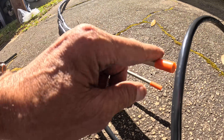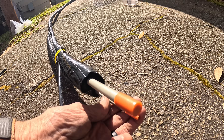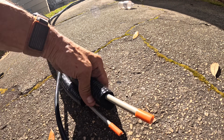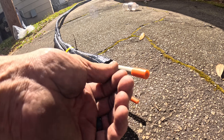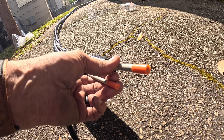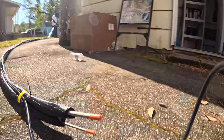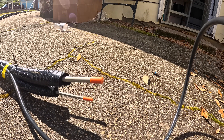I'll show you what it looks like. You can braze on this with 45% silver, copper to steel, and they want you to cover it with a shrink wrap if you heat it up and braze on it or if you sand on it, because it is steel. But we intend to just be pressing or flaring, so that's what we're using.